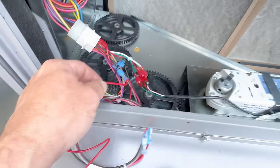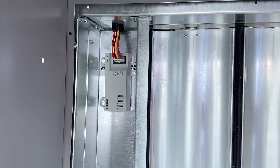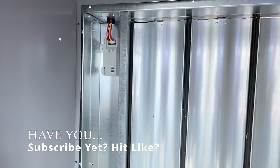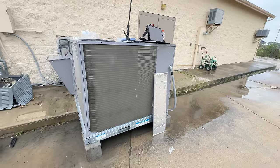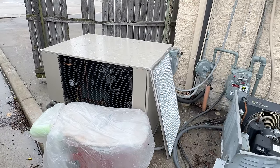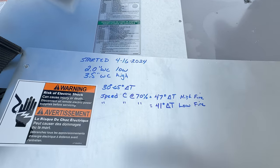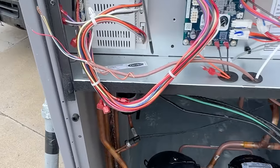We matched up the wires, which we had to verify since there were no instructions — pulling it off the iPad. We mounted the little sensor down here in this channel. Keep in mind, a lot of times guys will wash this out not realizing there's a sensor in there and end up destroying it. What happened on this site is a semi came through and wiped out the HVAC units. This one is new; I did the startup in April.